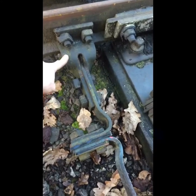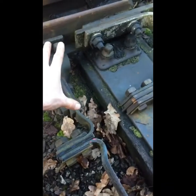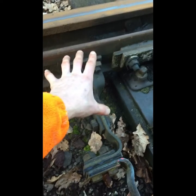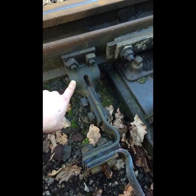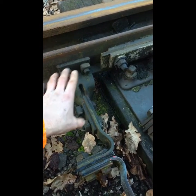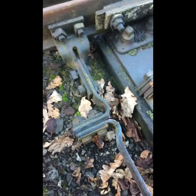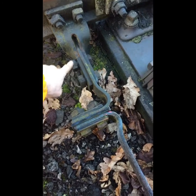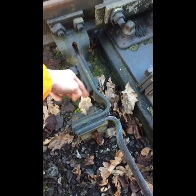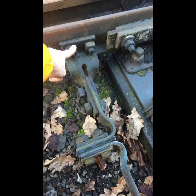We have our shoes which connect the stretcher to the rail — there are two of them. These are for bullhead rail, which have a slightly smaller foot on them, and then you have a longer one for flat bottom rail. On modern points you would have an orange shoe for the bullhead and a yellow one for the flat bottom — there's a new standard for the rods now, hence the color changes. You'll also notice traditional bolts on these, which just have a spiral washer behind them as a spring washer, and standard square-headed bolts.